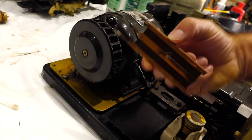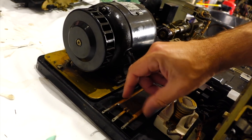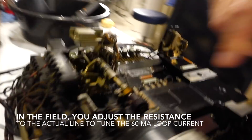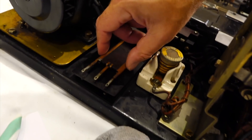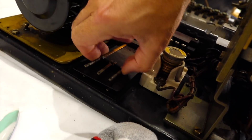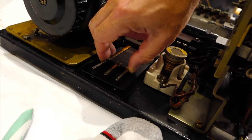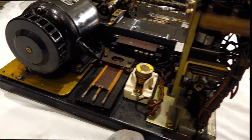We figured out what these resistors are — they are a military modification made for fill units, where you would adjust the current in the line by putting those resistors in series. You wire them up using the block over here. If you need it, you can wire one of the resistors or the second one. If you needed intermediate values, you could short those to create a whole range of values that always provide the same current needed in the line.